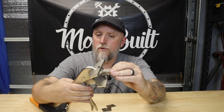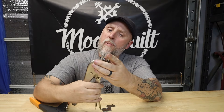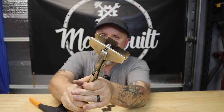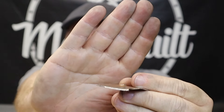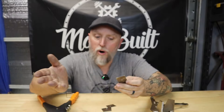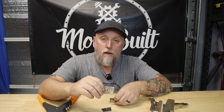But if you want it to sit flush, what you do is real simple — put this in here. These jaws don't line up the best; like I said, it's a homemade tool. But clamp it together, and now you've got a little miniature dimple die — perfect for the head of that rivet to sit in.